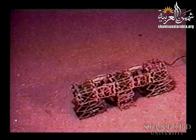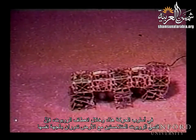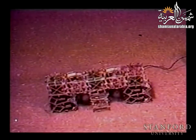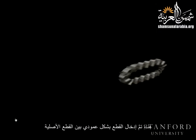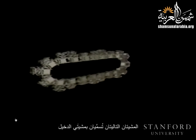This next set of locomotion gaits combines simple modes to achieve more complex locomotion. Segments are added perpendicularly, interspersed between the original segments. This gait may be used as a platform to carry objects — the more modules used, the larger and heavier the object may be. The next two gaits show the robot turning. In one gait, the two feet in contact with the ground rotate with respect to each other and must slide on the ground, which would create problems for dead reckoning or walking on carpet. In the next, segments are placed on the ground at one end and picked up at the other, so no sliding occurs.